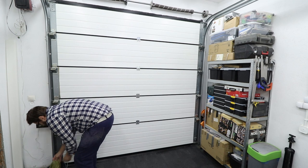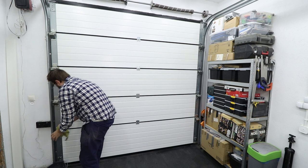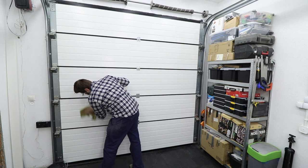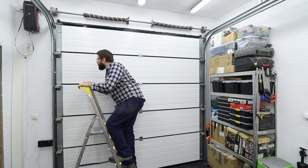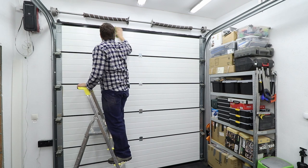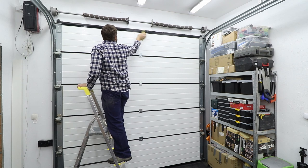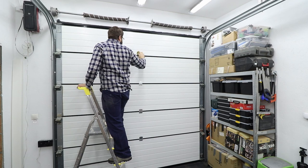One very important thing to consider when trying to insulate your garage doors is how much weight you can actually add to the panel doors, if any. I emailed the people who made and fitted these doors, and they said the maximum weight I can add is 15 kilograms for the mechanism to still work correctly. Fortunately, the solution I've got weighs about eight kilograms in total, so I'm well below the maximum threshold.